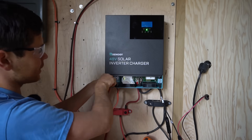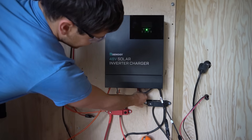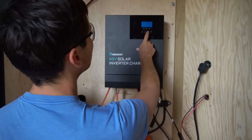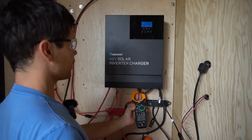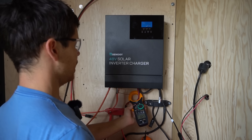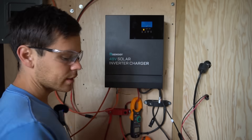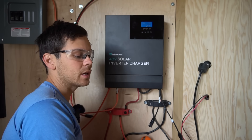Everything is finally connected. We have an ungrounded cable and this thing wants to wiggle around — not that great. It does have a power saving mode, so let's see what the idle consumption is in that mode. It's pulling 0.6 amps, which is not that different than without power saving mode. It's not going any lower, so 0.6 times 50.3 volts is about 30 watts. So in power saving mode it's essentially the same as the GrowWatt.